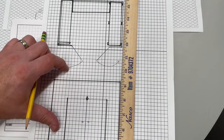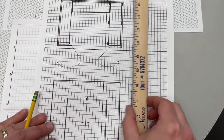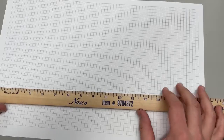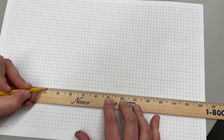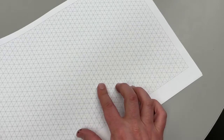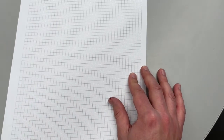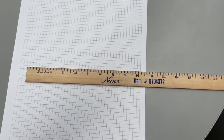We're going to reproduce this right now — you're going to draw along with me as we do this and draw a scaled version of this room to start laying out what we need for materials. To begin, we need a fresh sheet of quarter-inch graph paper, which means every four squares equal an inch. The grid is exactly quarter inch, so every four squares lines up to one inch, two inch, three inch, four inch. We're going to orient the paper vertically on eleven-by-seventeen. We also need a ruler — these rulers from the art department are broken down into eighth inch, which makes life a little easier.